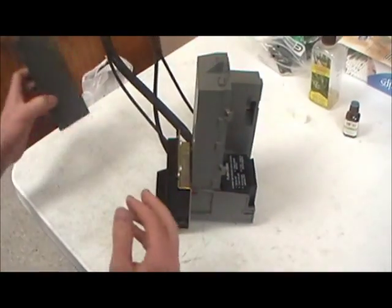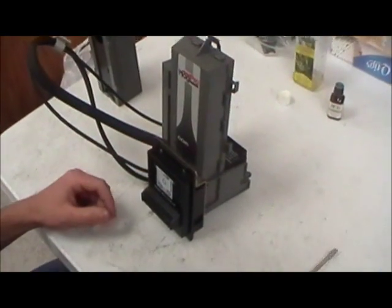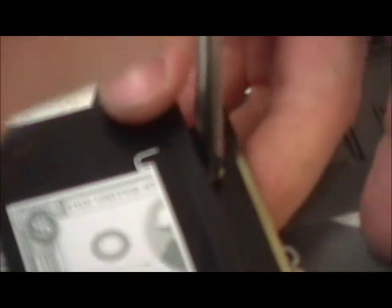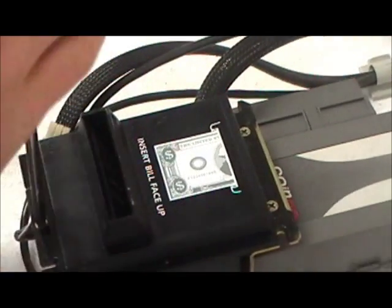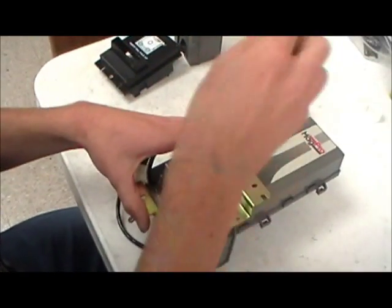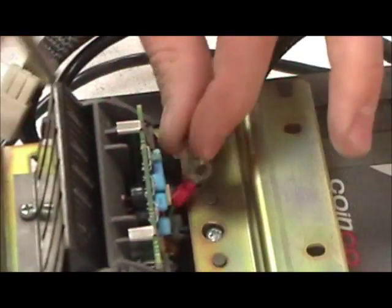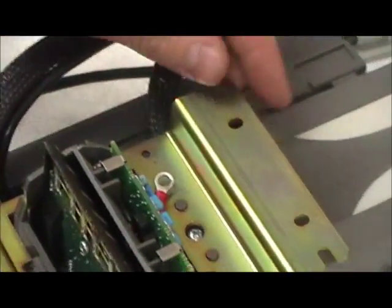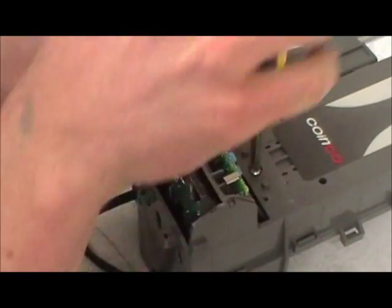The first thing is to take the bill box off. You're going to need a flat-headed screwdriver and a Phillips screwdriver. Start by taking the three screws on the bezel off. The bezels are all different, but the number of screws is the same. Then take the back plate off behind it. There's also a screw in the center that you have to remove.